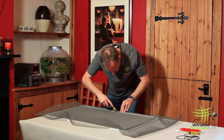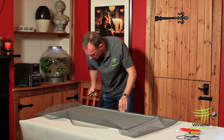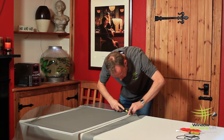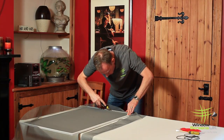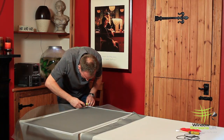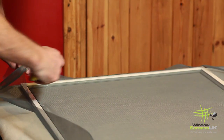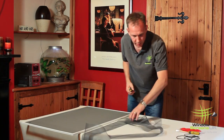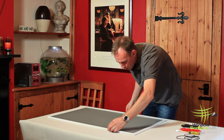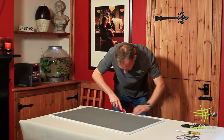Again, a nice steady flow. The good thing about this system is that we don't have to trim until we've finished. Again, just round the corner, discard the excess mesh. What I often do now is just do one final run along with the roller and a check as I go, just to make sure it's all nicely tucked away.